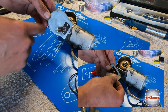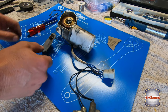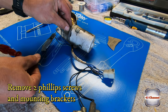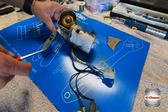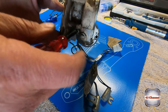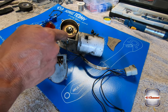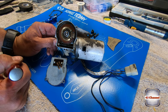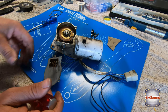I've cleaned all this up and it's come up quite nice. Just run over these with a little bit of emery paper. We'll remove the motor, which will bring out the worm drive, the whole lot — two Phillips head screws. I'm going to remove this; it's going to pull the entire worm drive out. We need to be really careful because just inside here there's a very small little ball bearing, and there's also a ball bearing on the inside of this, so we don't want to lose them.